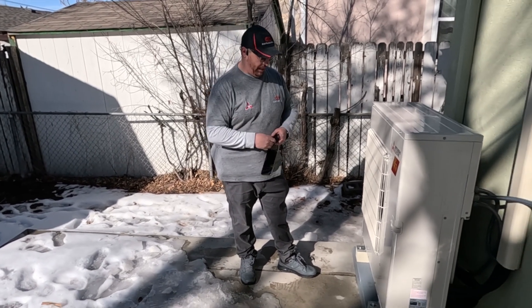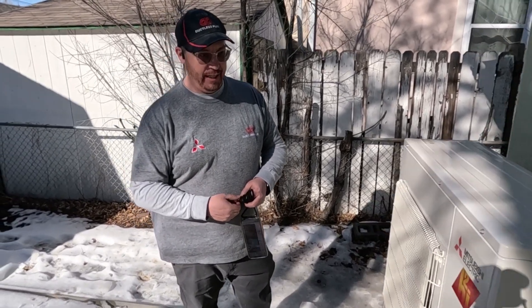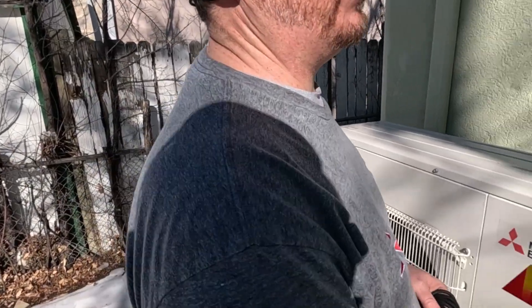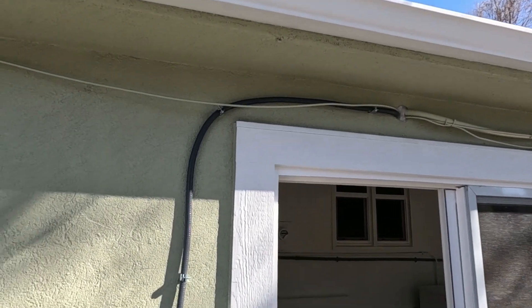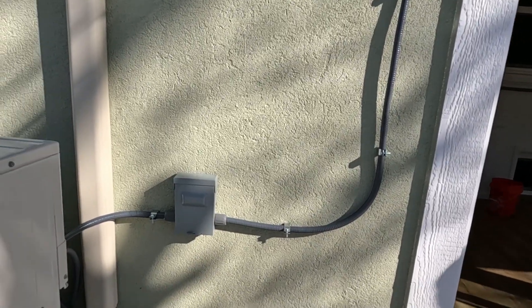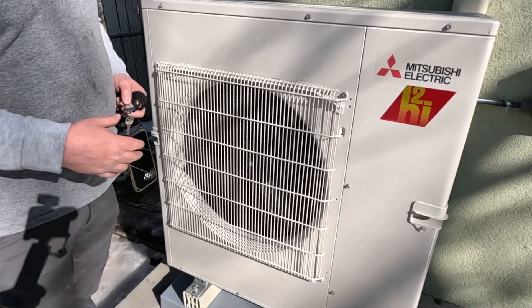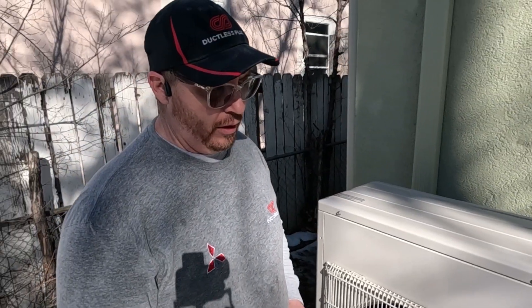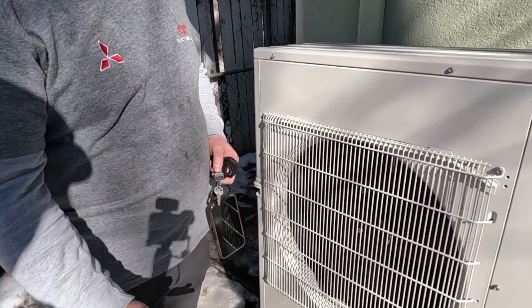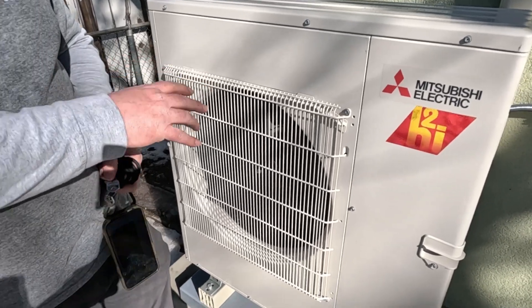I just want to show you — we're finished with this hyperheating unit. It was a pretty tough little job; it was a two-zone MXZ20 hyperheating unit. There was already a hole up there that they didn't caulk. We ran the seal tight and put a service disconnect out here. This is the condenser — you can hear how quiet it is. The hyperheating units can do heating all the way down to negative 13 at a pretty efficient amount of their capacity, though they do start to tank off after negative 13. Mitsubishis are quiet machines.